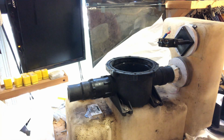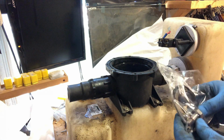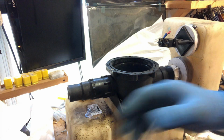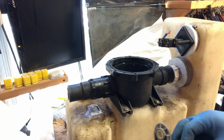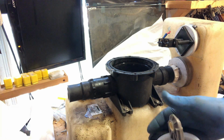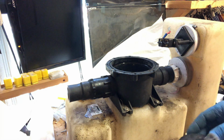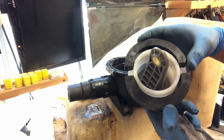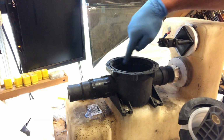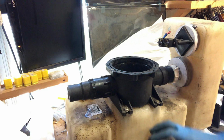All right. Here are all our O-rings, new shoulder bolt for the new motor. New bellows with the half rings they were talking about earlier. Those go in here like that, and then they'll put pressure on the outside in this groove of this case to seal the top of the bellows. Oh, sorry, you couldn't even see that. So those are the half rings. And there's a groove in here, about that deep around the top. Okay.